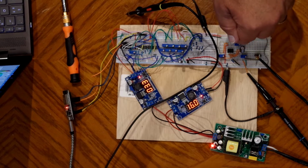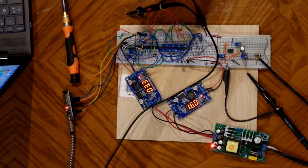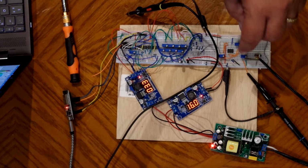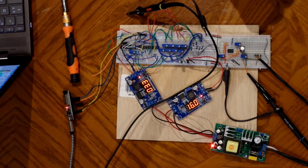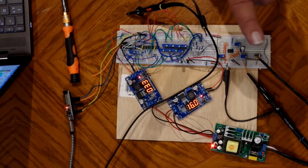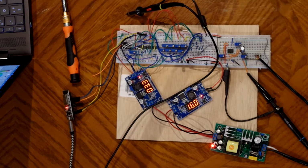From here, we're jumping from having a positive voltage offset, sending it through a cap to make it float above and below zero ground. And then this little pot here is an attenuator to drop it down to a voltage that's good to send out analog and drive an RCA input.